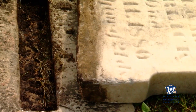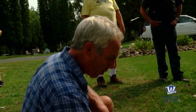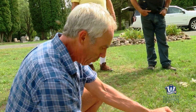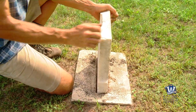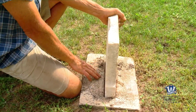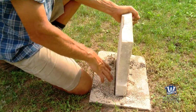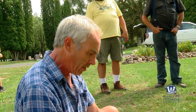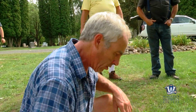So we would want to level the lower base first. And again, this is like a regional material, like a sandstone or limestone. This is a marble. If we were to level the base and clean it all out, then we would use a historic pointing mortar. Then we could join this, and it goes right down to the inscription because there's loss, but we can just about save all the inscription if we're careful how we set it. So then we would put a historic pointing mortar in here, point it in with a tuck pointer, get that plumb, and then we could join the top on it.